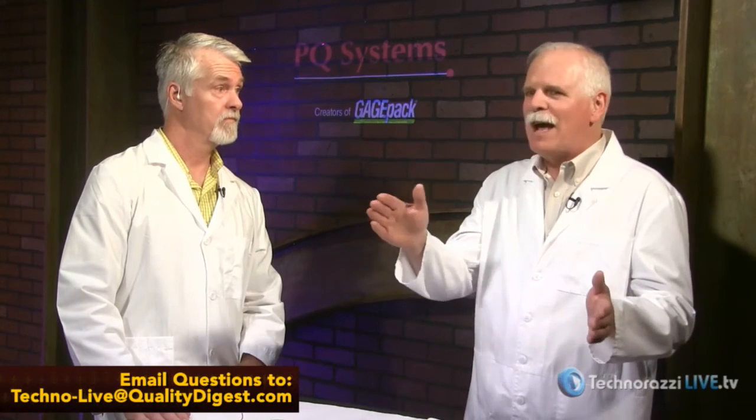You know, a lot of the torque wrenches nowadays, they might go from 0 to 100 pounds, but they actually quit numbering it below that 20% range that they want you to stay within. It will still physically lock in, but they don't want you using it outside of that range.